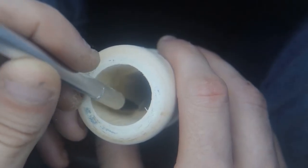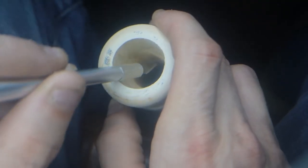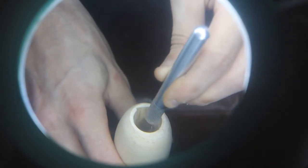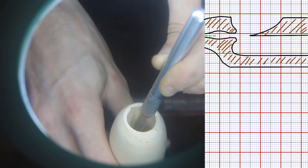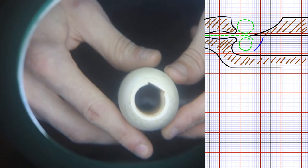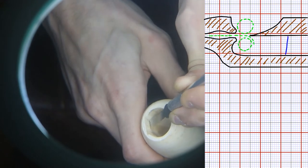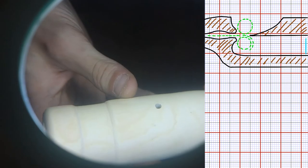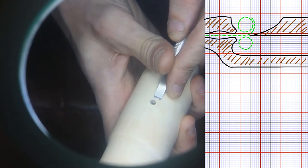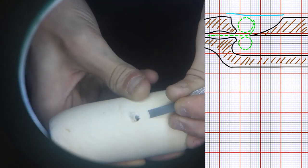So, while I clean up some lint, it's time to talk about edge tone. Because when you have a jet of air that exits an orifice and hits a sharp edge, you will get a pressure differential. And this differential sets up oscillatory motion in its vicinity. Now, a lot of the underlying mechanics of this phenomenon is still a mystery. But we have certain parameters that we can characterize the system by.